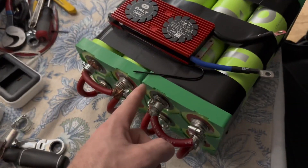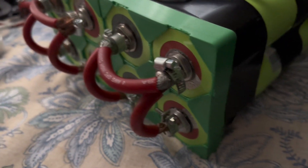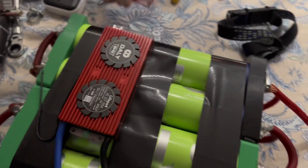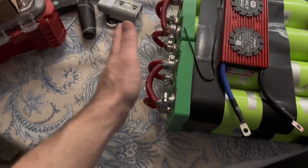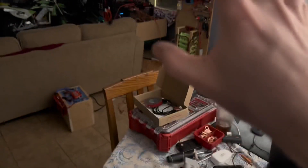We got this pretty much buttoned up. I got the batteries taped together, put a little bit of double-sided tape between these little cell holders — these are 3D printed. They're kind of ugly. Do you think it's a terrible idea, or not bad considering the situation that I don't have the nuts? Either way, we're going to test it. All I have to do now is connect the BMS. I'm probably going to put a little nick in here and solder the balance harness. Then we're going to put a discharge lug there and connect an Anderson connector as our discharge. We'll put some tape on the ends to make sure we don't short circuit anything. So this would be a hundred amp discharge battery — 110 amp hours times 12.8 is your watt hours. Not too bad.